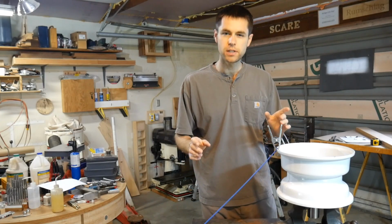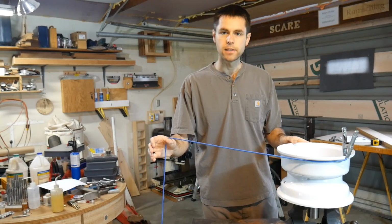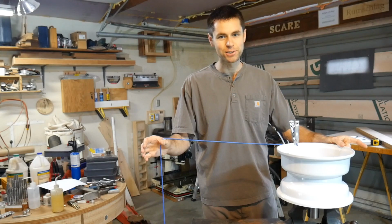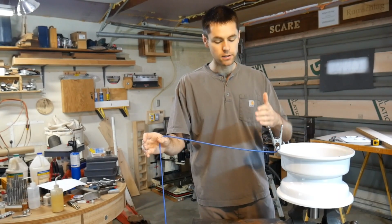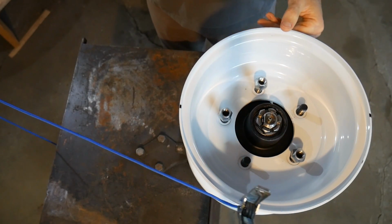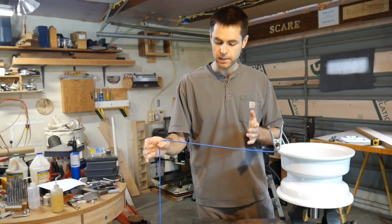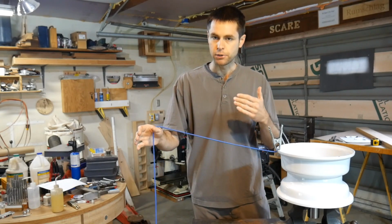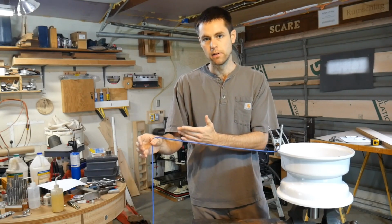Another cable strategy which seems promising at first is to set the cable up so that it's wound and the rotation unwinds it, and when it goes over center, it changes direction and begins to pull it back in. This is really emulating what's going on with the solid arms, but doing it while keeping the cable in tension. And the difficulty that I see with this approach is that you have to maintain this tension over here, and you are relying on that tension to expand the table.